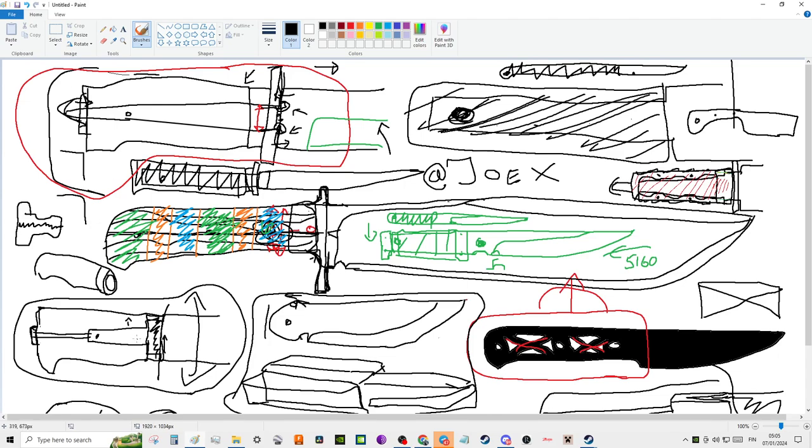One way to do that, of course, is to do this, where you bring the tang as far back as possible, and then just have the end here threaded. But again, you don't have a lot of material, so personally, if you want to use the threading, you can use the nut to squeeze your handle forwards into the shoulder of your blade here, to get a really nice snug fit, right? And then after that, put a little pinhole, drill through, and use glue or whatever.